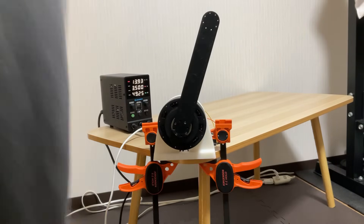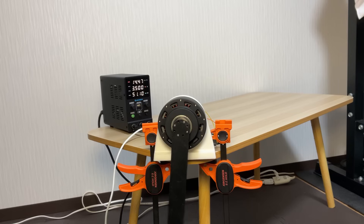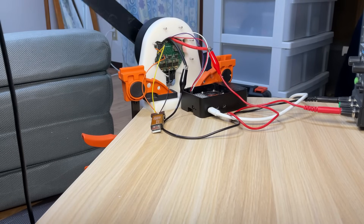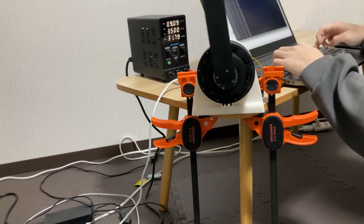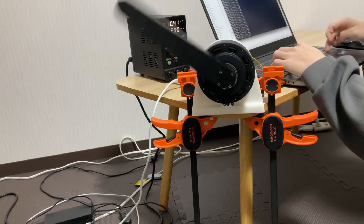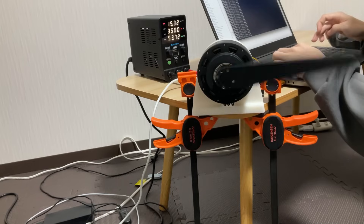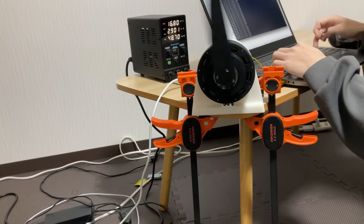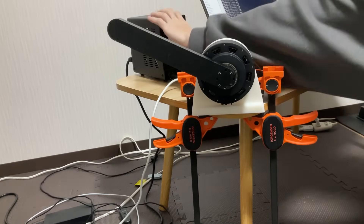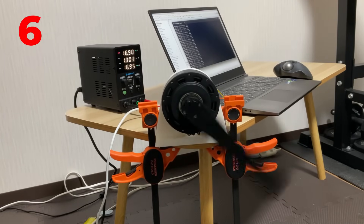Now let's run a few tests to check the actuator's performance. First up is the angle control test. We're sending commands where the target angle shifts by 45 degrees each time, and as you can see, it's tracking them very accurately. Next, let's test the actuator's top speed. We're running at 16.8V and capping the current at 3.5A for safety, then gradually increasing the rotation speed. It's spinning so fast right next to me — it's really scary. Around this point the rotor can no longer keep up, so we took that as the maximum speed and measured it from the video. It turned out to be 142 RPM.